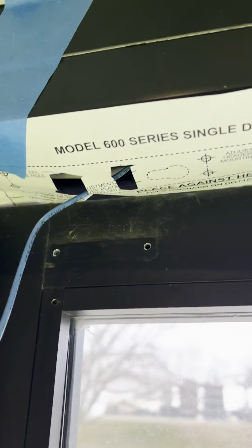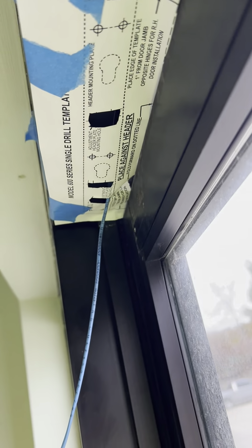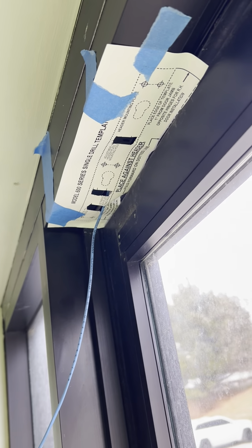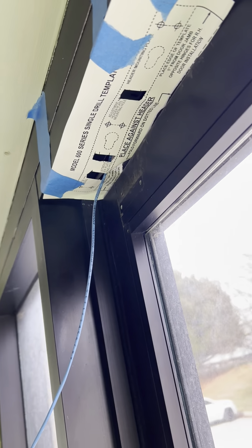Let me show you the door that we've already put the template up on. What we've done is the first thing I'm going to put in is the sill plate. On this particular door, we had to take the door frame off at the very top because it did not give enough room to have the magnet on the door without building out the plate. So we're going to put it in here and then modify the rest of the top sill. I've already run a wire down in and marked the spots on the door. The next step is drilling out two small holes so we can put the plate up on the door.